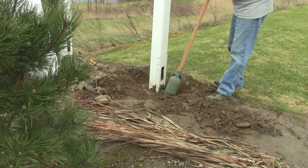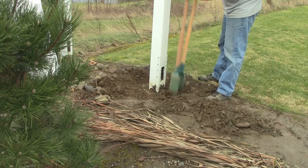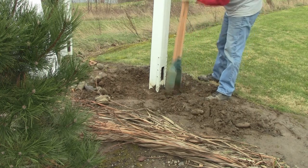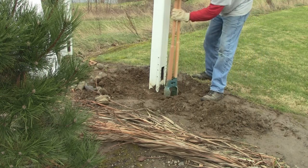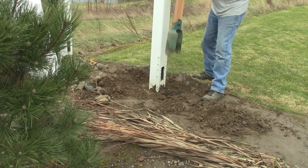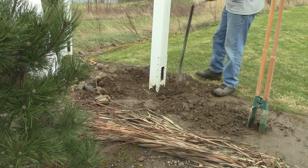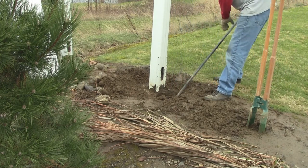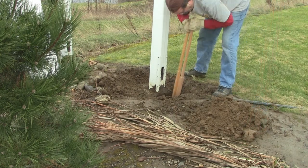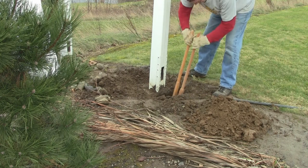Come in with a post hole digger and put a post hole right directly adjacent to the concrete. Dig this down as close as you can to the bottom of the existing concrete, then once the hole is as deep as the bottom of the concrete, widen it out to about as wide as the concrete itself. You may have to use the San Angelo bar to make that hole go a little deeper. In this case the dirt was pretty wet but also compacted for many years, so use what you have to. Follow up with the post hole digger again to get all the debris out of the hole all the way down to the bottom of the concrete.